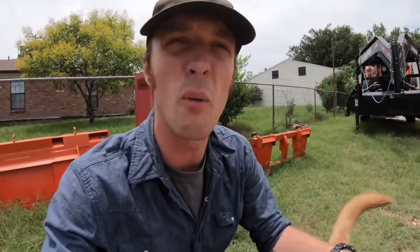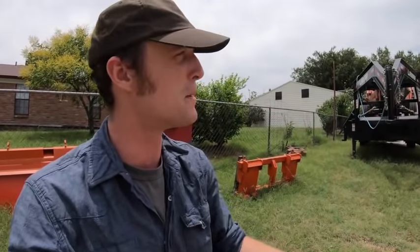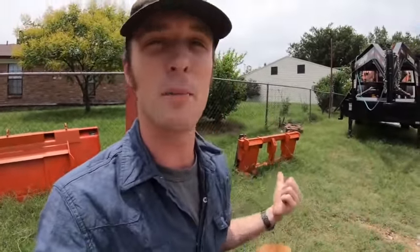Now, obviously you can use a heavy implement, like a rotary shredder or a garden tiller or something, but there's two reasons why I didn't want to do that. One, they're not all that heavy. I think even my big Land Pride shredder only weighs like 1500 pounds or something, and I think most garden tillers are less than that. The other thing is they're pretty bulky for the weight that they have. So if you're going to be maneuvering that around buildings or vehicles or other farm equipment, it's not the most ideal thing in the world. So I decided I would use my welding skills to fabricate a pretty simple counterweight for this.